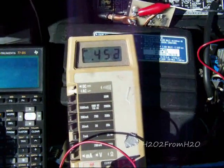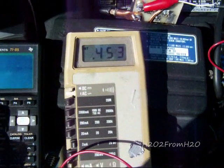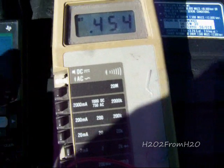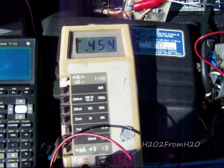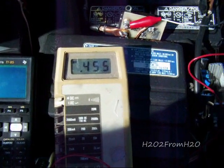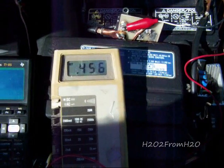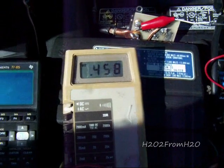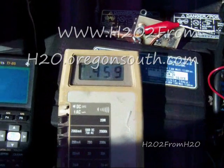We're running approximately a 50% duty cycle and we're looking at 0.453. It's hanging out right around there. The stability is really good — the frequency isn't affecting it. The accuracy of my poor man's shunt, I can't vouch for — I've never compared it on anything over 3 amps.